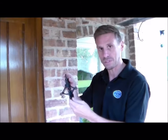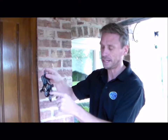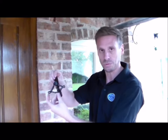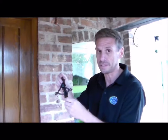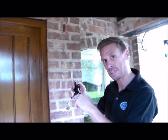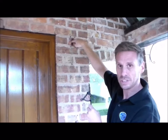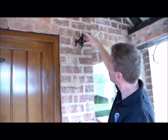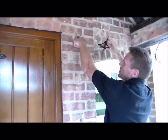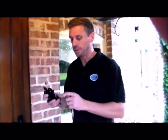We do two versions of the butler bell: an electrical version and a mechanical version. The electrical version doesn't have the rear section — it's purely an arm at the front that presses a button when pulled, so there's no chiselling required. We're describing the mechanical version here. The next step is to attach a cord to the back of the crank to connect to the bell on the inside, then drill a hole all the way through the wall so the cord can pass through.